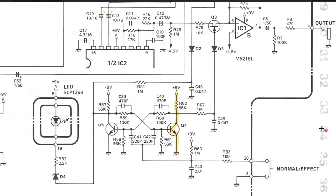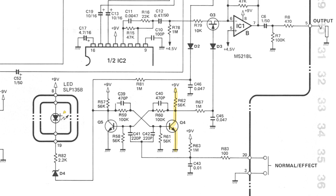Now that Q4 is on and Q5 is off, will the LED turn on? Will the effect output a wet signal, or is the pedal off? Let's find out. We have a 5.6 volt zener diode here. In order for current to flow through this LED, this zener has to be conducting - it needs 5.6 volts across it. So from here to here we're going to need 5.6 volts plus around 2.5 volts for the LED plus another volt across this resistor - we're going to need 8 or 9 volts just to turn on this zener so the LED can turn on.